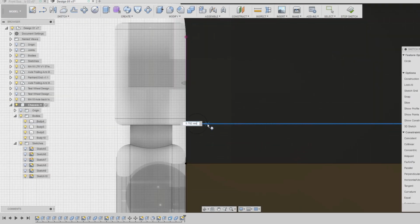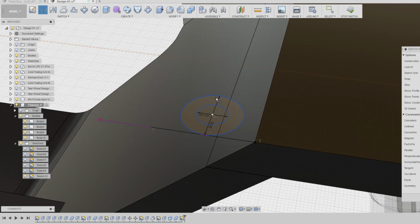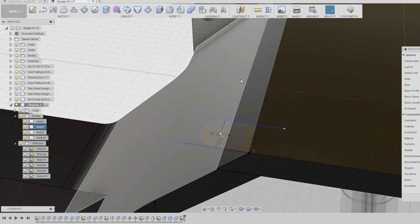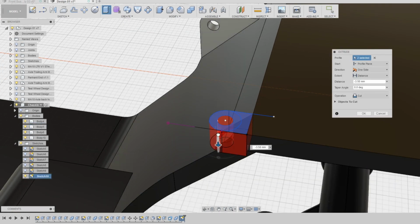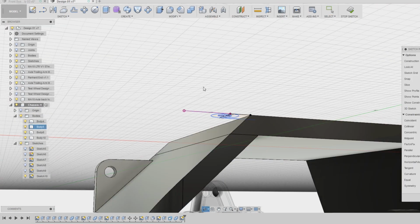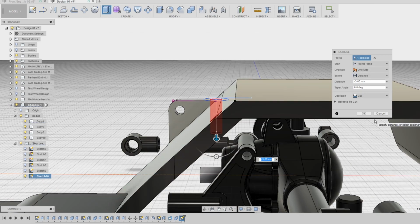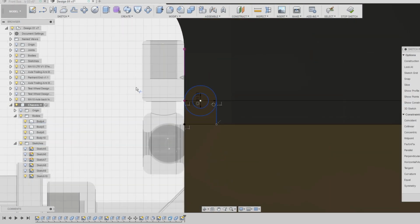At this point, I wanted to make it so that the top piece that connects the front part of the chassis to the back section can be secured using screws. I made the screw holes quite small, only requiring a M1 by 3mm screw. I'm hoping that this is enough to make a strong connection between the pieces. However, if I need to modify the design to accept larger screws, that can be done without much hassle.